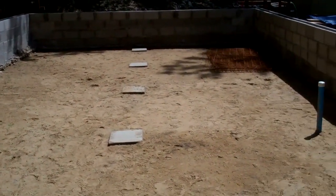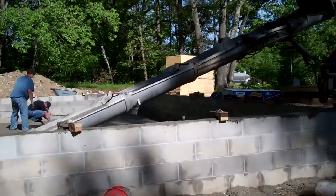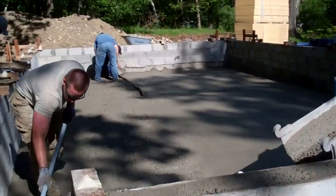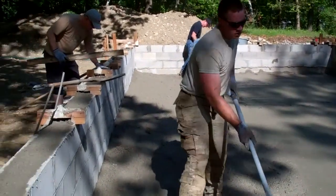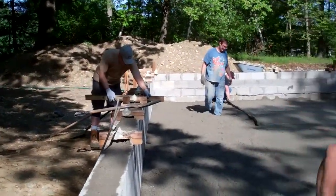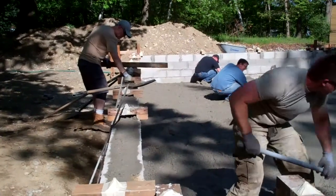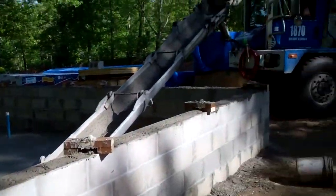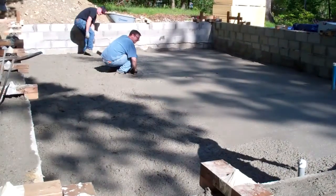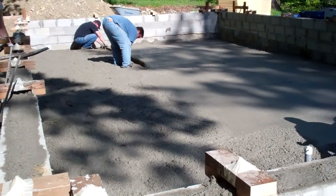Concrete's coming in about five hours or so. We've got the cement pump here. We've already filled all of the cores and now it's going into the middle of the house where we'll have our concrete slab. We have David, Preston, John in the back, and my dad helping to screed the concrete — those are the bond beams. We'll screed the whole floor and then use the float to make sure everything's level and air pockets are out, giving us a nice concrete slab for the crawl space.